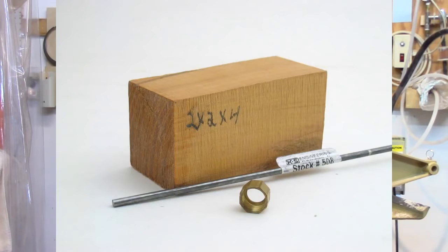What it takes to make an awl is a piece of wood approximately four to five inches long, a metal shaft of suitable steel — I'll give you a source for that later — and some type of ferrule, as shown here. In terms of woods, I've made awl handles out of all types of domestic wood: oak, cherry, maple, laminated, exotics. Exotics look nice, figured wood looks very nice, spalted wood looks nice as long as it's not punky.